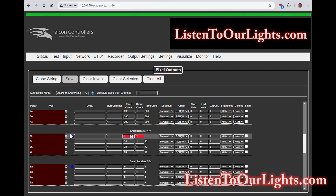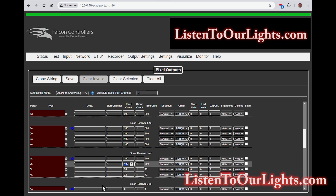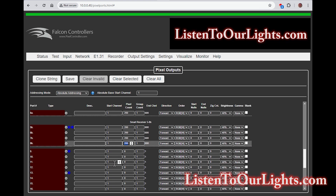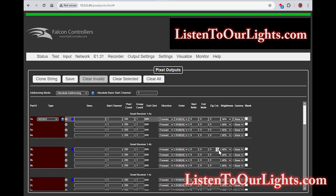So I'm going to set the chain receivers to 100 pixels each — even though the hardware has 200, I'll configure it as 100 to stay within limits. For ports 5 through 8, I set 200 pixels for each of the two receivers. All channels were at 40% brightness; I change it to 30% and hit Shift+F3, which carries that 30% all the way through. F3 and Shift+F3 are tips picked up at the Florida Mega Mini from Keith Wesley's class on advanced Falcon controllers. Then we save the configuration.